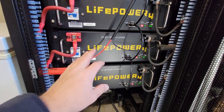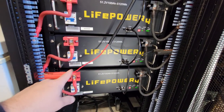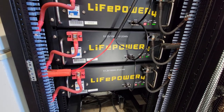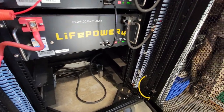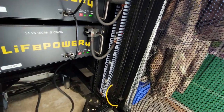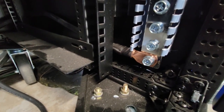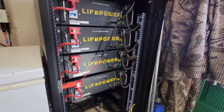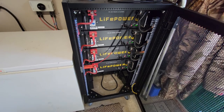I just have the charger through the hole up there, clipped onto the bus bar, so all we've got to do is plug it in and it's ready to use. I did flip the negative bus bar over — the holes all line up — and I feed the negative into the bottom for a little better balancing and equalization of all the batteries. I haven't had a single problem out of that.